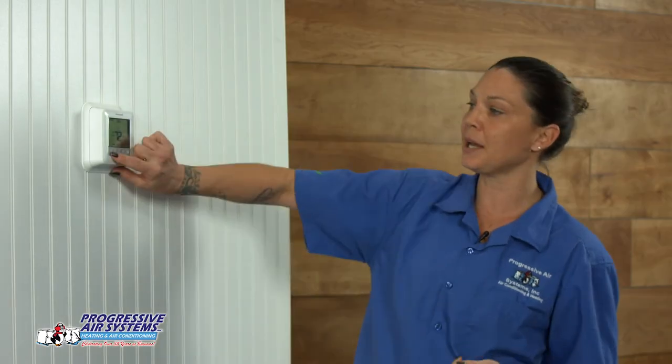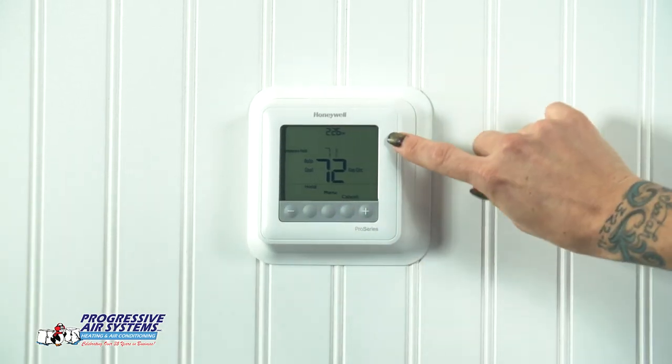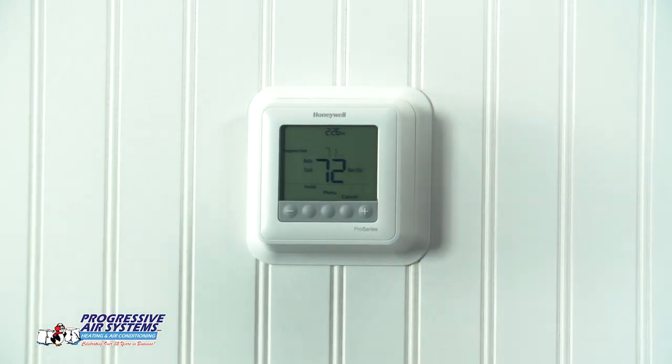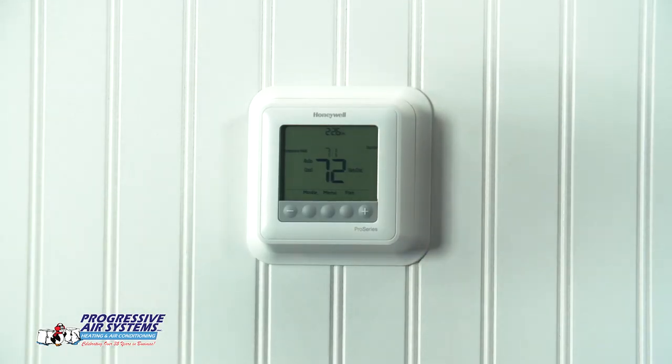If it comes back on and you notice cool on is blinking — normally when you turn the temperature down you see it up in the corner, and once it stops blinking it'll say cool on. If that's ever flashing, that means your thermostat is in a time delay, and that's to protect your compressor from short cycling. Just wait until cool on is steady and your system should come on without any issues. If you do have issues, of course, give us a call.